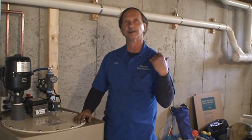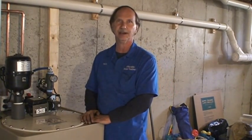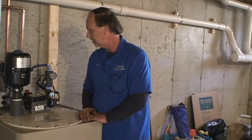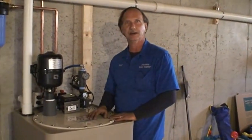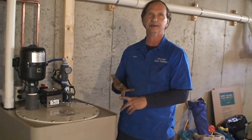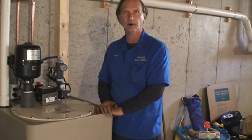I know in some cases with the juniors, people running outside faucets do run out of water, because an outside faucet can get eight to ten gallons a minute — and if you're only filling at five, you're going to run out. On an average house you'll never run out with the senior because you're always starting with 55 gallons of water. There isn't anything in the house — a shower, doing a load of laundry — where you'd use more than 20 to 30 gallons at a time on average.